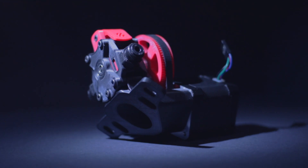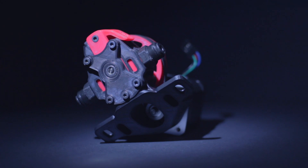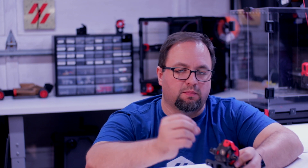About a year later, we released Mobius III. This was an evolutionary step on the Mobius design. It used a lot less plastic, it was nicer to look at, and it used a more conventional 80-tooth printed gear that has a 20T pulley inside of it. Same as Mobius II, Mobius III featured the Lambo doors, but now they were a stack design, and the way they were printed actually improved the filament path quite a bit. It still had the latch and unlatch system. Effectively, this was the last true Bowden extruder that we've released.